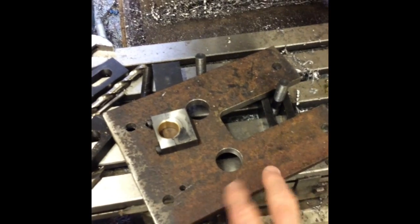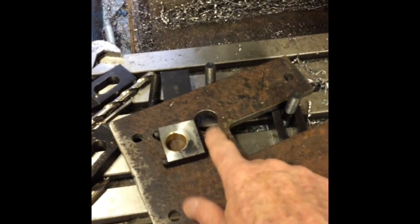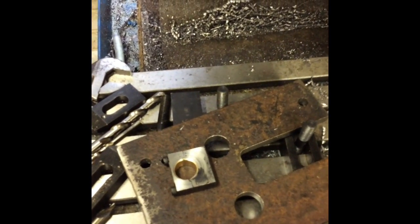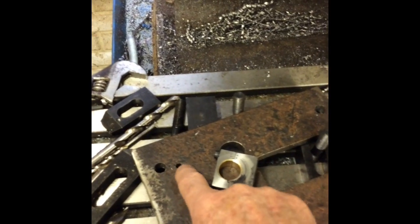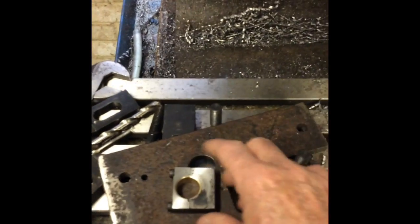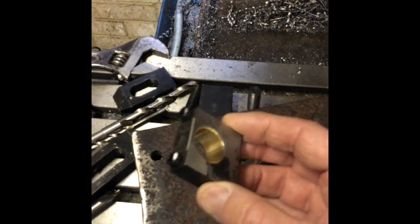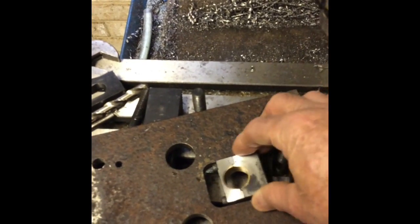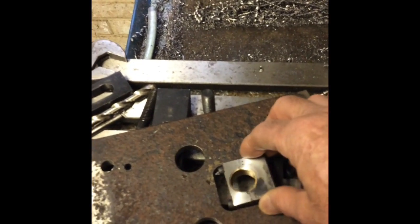This is the next part — this is the end plate. I bored it out. Everything is located really precisely; I'm absolutely anal about things like this. These are for spring pins that will go in there, and then this will locate to the next one, so it will always be located. This, of course, is the bearing I made earlier — the bearing block, with bronze welded inside.